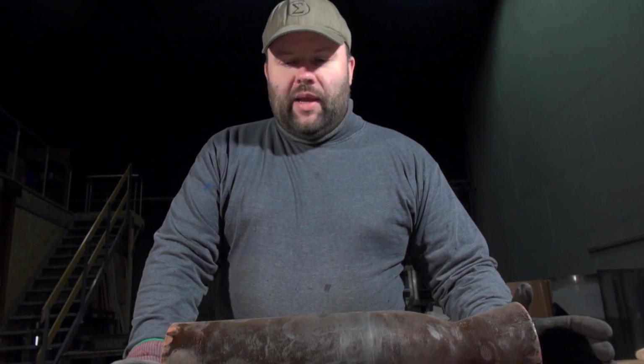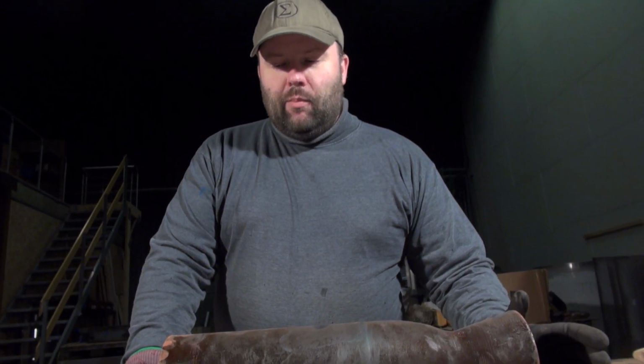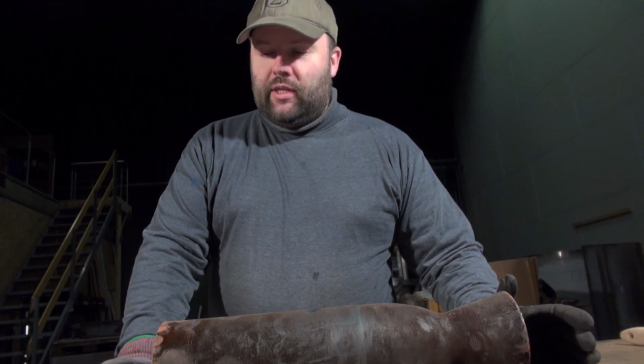We borrowed a ceramics oven, which we modified slightly so that we could inject inert gas, in this case argon, which we use from our welding machinery, into this ceramics oven. The basic idea is that injecting this inert gas forces all the oxygen-rich atmosphere out of the oven and should allow us to reach the very high temperatures required for the tempering without the surface of this steel tube getting corroded and oxidized.